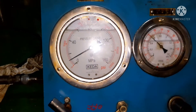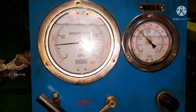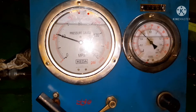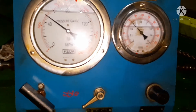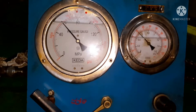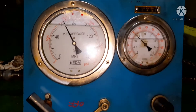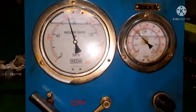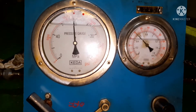I started the pump and the pressure is increasing. I have to bring the pressure to almost 860 bar. Once this pressure is reached you can check the hydraulic nut to see whether it has already loosened. You can see the pressure is gradually increasing in the hydraulic pump — that means your hydraulic hoses are now holding pressure.